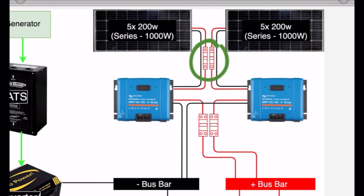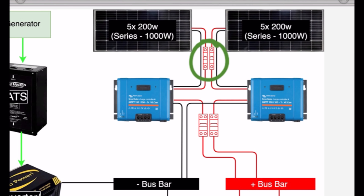Those come straight down into the front bay, go through some 15 amp breakers. Again, I sized the breakers to the wire, even though those panels are only going to supply about 10 amps. The big thing was I couldn't find 10 amp breakers. I knew the wire could handle 15 amps, and that's the main thing, is you want to protect the wiring.